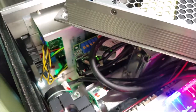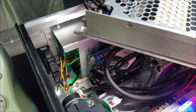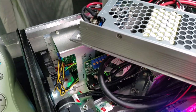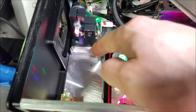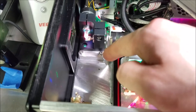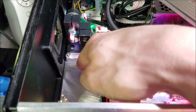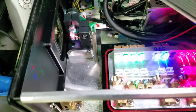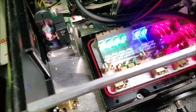Your laser driver in and of itself, it seems to have okay linearity. That's not really a problem. We have had a little hiccup with one of them, and that's concerning, but overall that's not bad. Let's see. Oh, there's another problem. Yeah, you see what's missing here? If you don't see what's missing here, you, sir, own non-Variance equipment, because there should be a shutter here, and there's no shutter. Fail on fail, you know. That's kind of important, so maybe install that next time you send one of these to the great land of America, because that's how the FDA likes it.